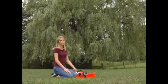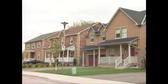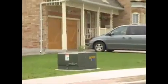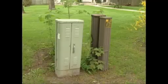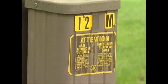You need to keep away from trees with overhanging branches and overhead wires and clotheslines. You should also check with your local utilities before you start to make sure you're not putting your pool on top of sewer or water lines, natural gas pipes, or buried electrical, cable TV, or telephone wires. Or in our location out in the country, over the septic tank.